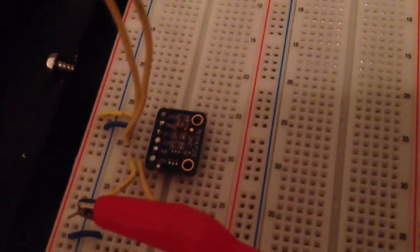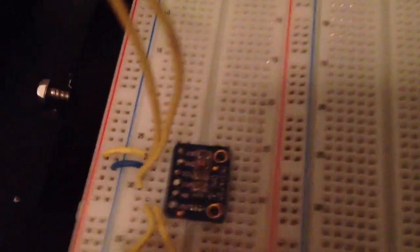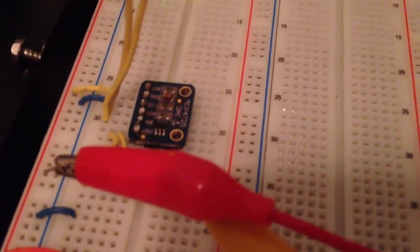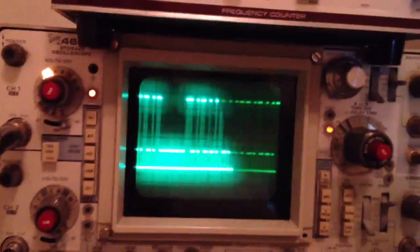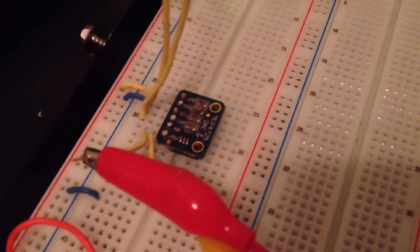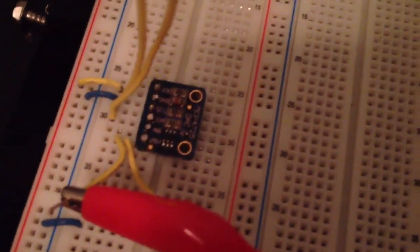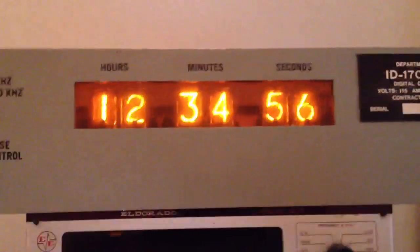The closest it can do is pulse width modulation. All right, so I had to go buy one of these, I want to say an MCP 4725. It's a digital to analog converter, a 12-bit DAC, and then write the code to essentially fake a sine wave by varying the voltage along a pre-calculated sine curve, and then try to pump that to the clock as fast as possible. The problem is, to do a pretty nicely granular sine wave artificially takes too much time. I can't pump 20 bits worth of data using a nice sine wave fast enough for the clock to hear it.